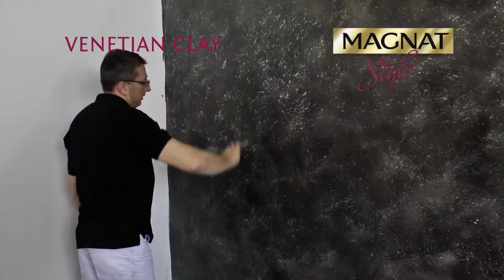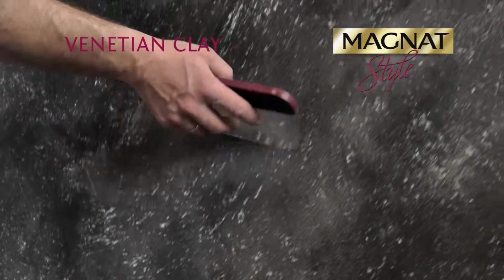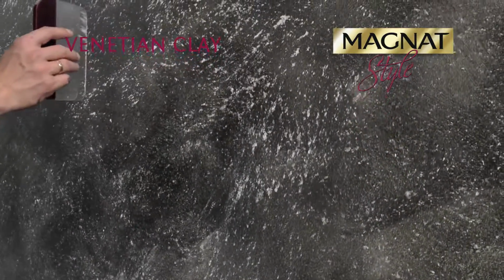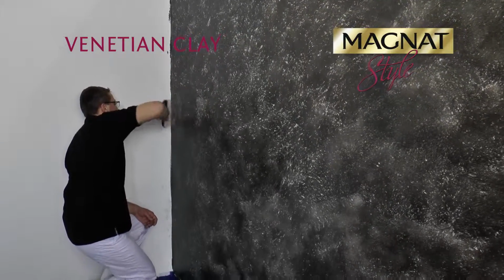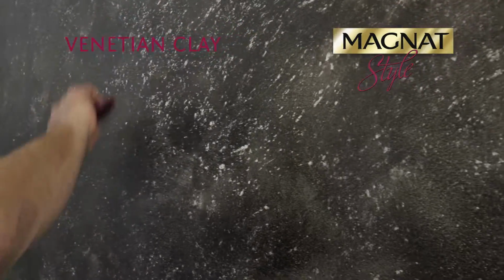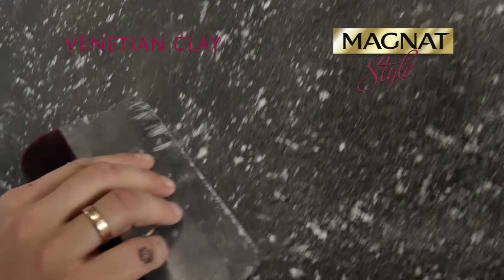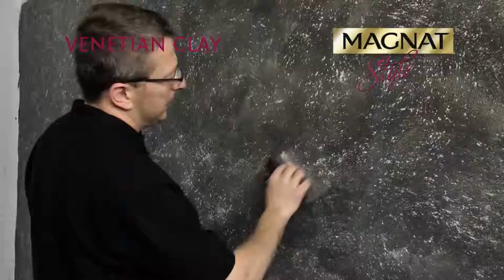After about 30 minutes, depending on the ambient temperature, use the dedicated plastic float to gently rub and crush the white particles. It is best to do the rubbing with the float in the same direction in which the decorative paint was applied. When starting to work with the plastic float, make sure the white particles do not stick to the tool. If they do, the coating is not dry enough, so give it a few more minutes to dry.